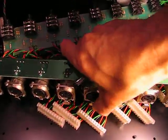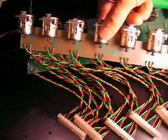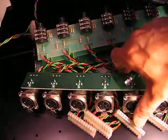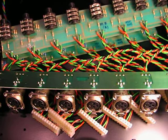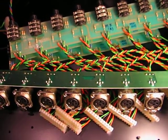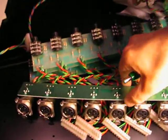But that's an awful lot of trouble — a lot of modification in the jack PCB — all for the sake of these things which I'm not really excited about. The other alternative is just to get new jacks that have solder cups in them, forget the jack PCBs altogether, and bond each of those directly to the chassis. That'd be another route, but it'd be an expensive route.